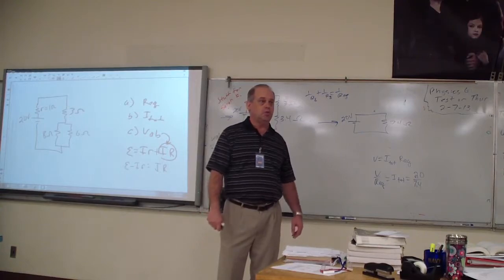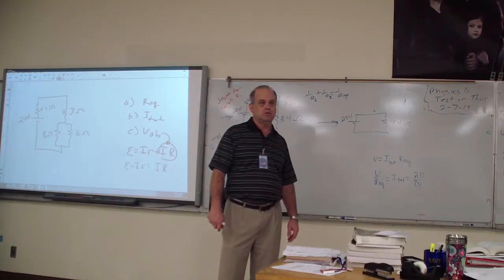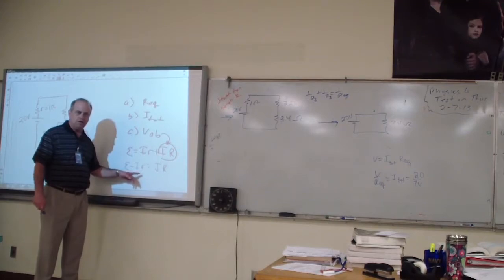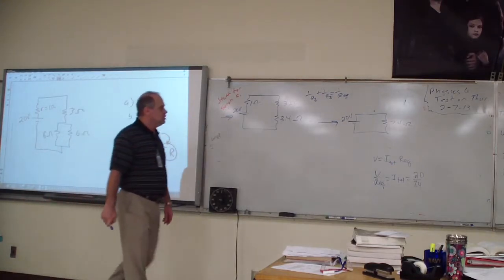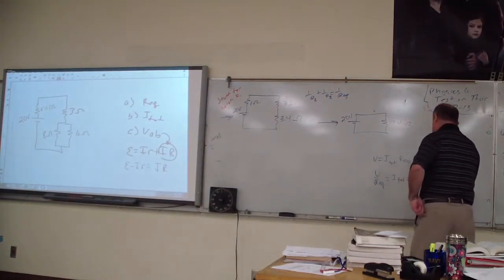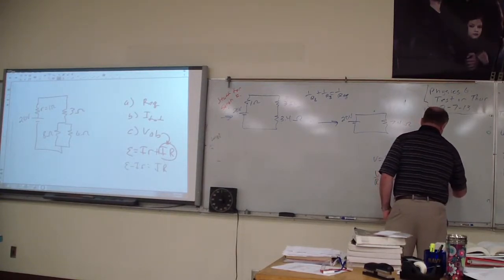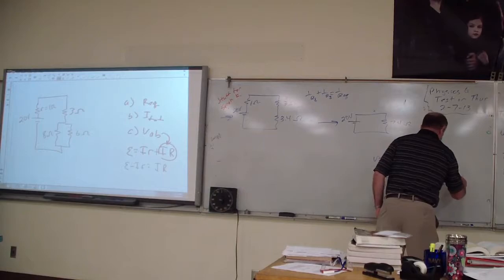What's the I? Well, I haven't got it yet. You with me? Yeah. Conceptually, why doesn't what I'm saying work? What are you saying? To get your VAB, all you need to do is 20 volts minus 1 ohm. No, you're saying E minus little r. R is not my voltage. I times R is voltage. Gotcha. All right. So, guys, we got our... Well, what's 20 divided by 7.4? 3.7. No, 2.7. Yeah, I was going to say, something's wrong there. 2.7 amps.